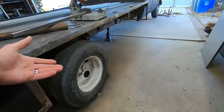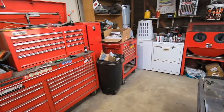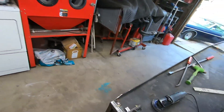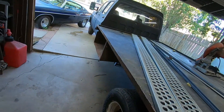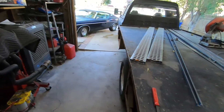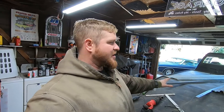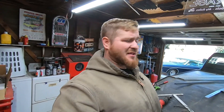I can start adding material back on this side, but I still have the ramp supports down there, that box up at the front that's kind of a mess, and the entire rail is covered in tack welds and bondo. I can't start thinking about how to allocate space until I get everything out of the way and reinforce the backbone, so I'm going to start by cutting everything off. You guys already saw what that looks like so I'll catch up with you at the end of the night.